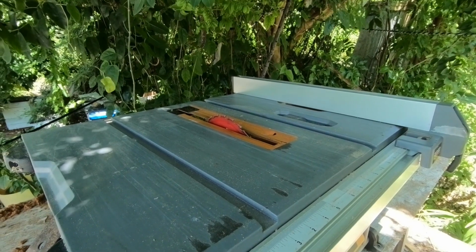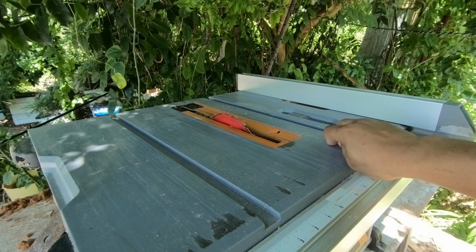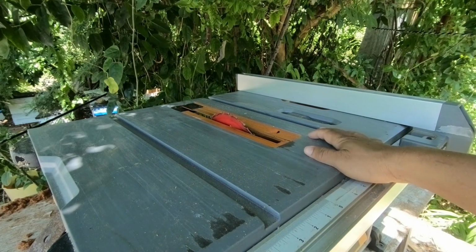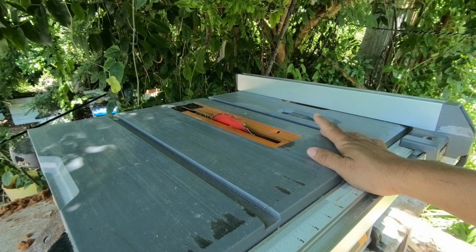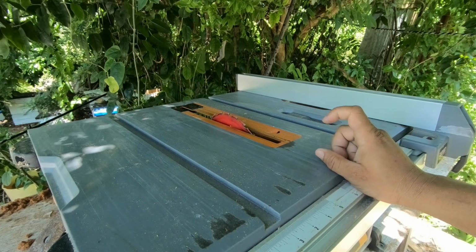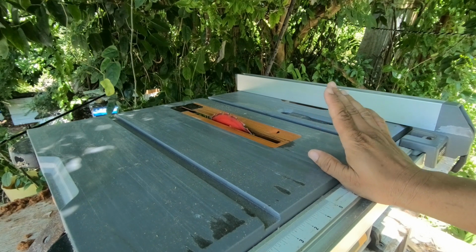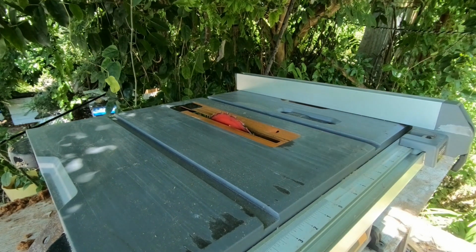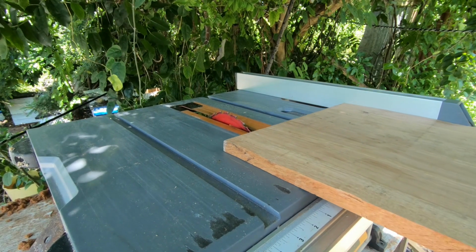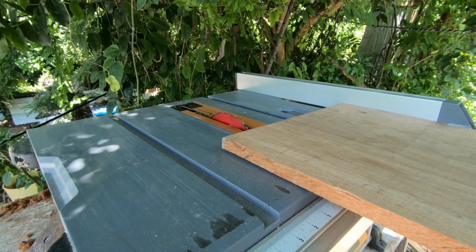Alright, so the saw has been dialed in to 9 5/8 inches. So that is gonna be the height of the box. Mine is a little over 9 5/8 inches, because not all of my equipment are built to spec, so I still give that little millimeter, I'd say, for any margin of error in the height of the previous frames that I've built. So now that we have that, we're just gonna have the side that we jointed up against the fence, and that will make this side the same as this side. So let me just run one through so you can see, and then of course I'll run the others off camera.